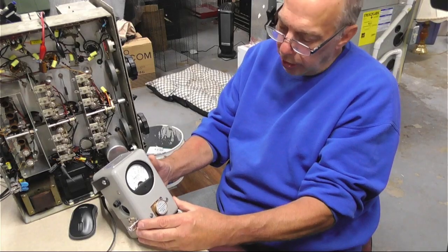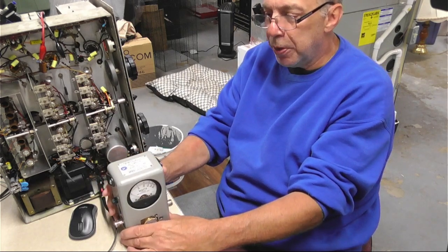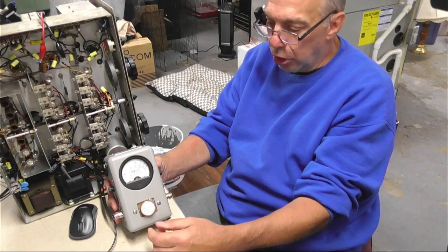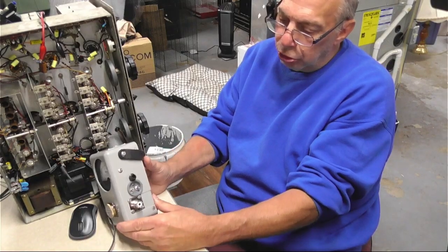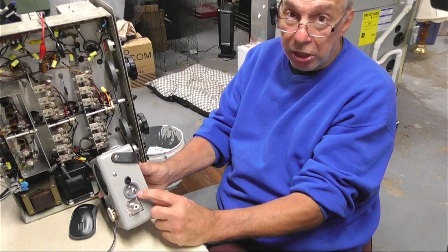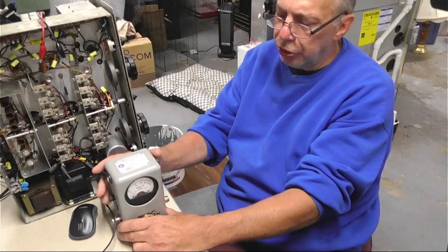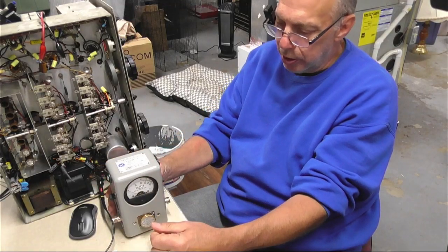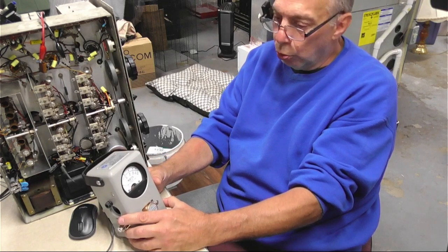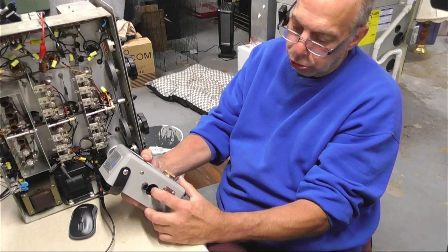I think that's all I can say about these. They're nice, they're expensive. It kind of gets to be one of these things where you really want to get a bird meter and you get one and then you realize now you've got to get all these elements. That's what leads us on to the rest of this. Some of these meters do come with a peak option as a factory setting — just the peak reading, not the times two and times five multiplier. I believe that's a Bird 43. I think they call it like a Bird 43 peak. So that's just a little breakdown of a bird if you always see them and wonder what the heck's a bird or why do people want them. This hole you're looking at right here is to store an extra element in.